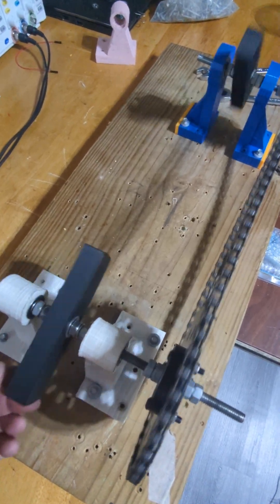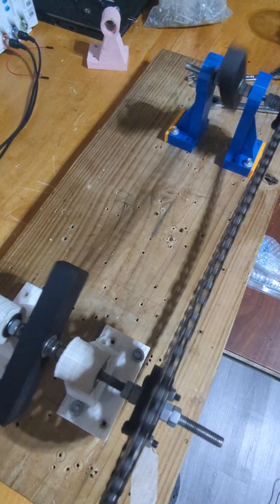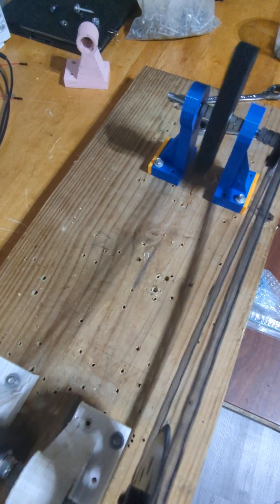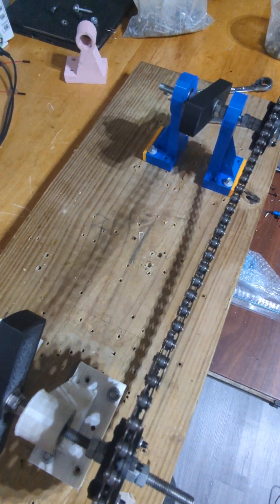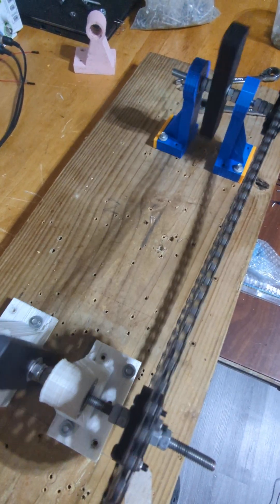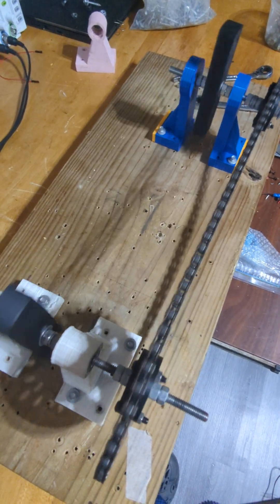The coils are going to go under here, the magnets go in, the coils wire in series — we need to make sure we get induction. Then I'm probably going to have to use a MOSFET switching circuit for the output, to only connect it at certain times which I think are advantageous.